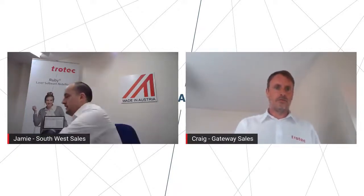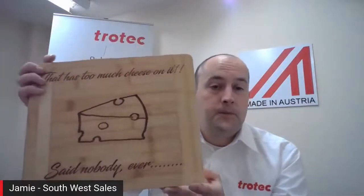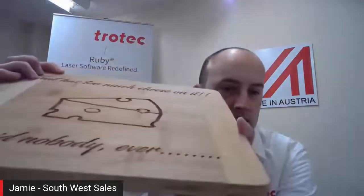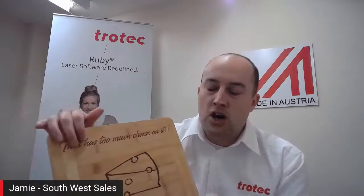Probably one we see quite a lot of now is your standard kind of chopping boards — you see these quite often, especially around Christmas time, as your Christmas eve boxes. Just engraving the tops of them. The beauty being wooden is the variety we can get. This one we've gone relatively deep in the engrave to get a bit of darker color. We can also vary the powers and speeds — what we could have done is change the text, maybe gone at 50% power and 100% speed to get a really light marking on one line, run it at full power and full speed to get a really dark finish.